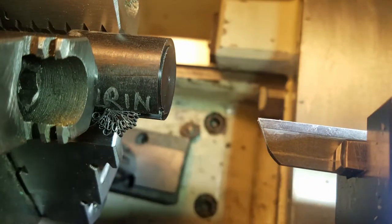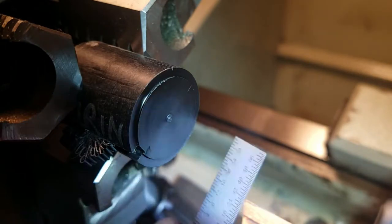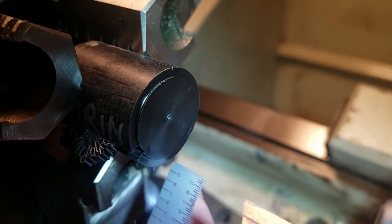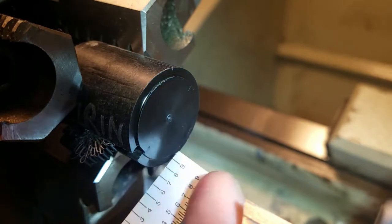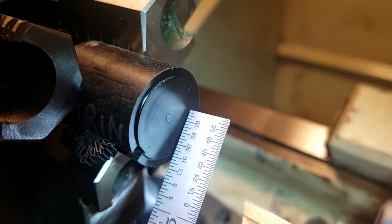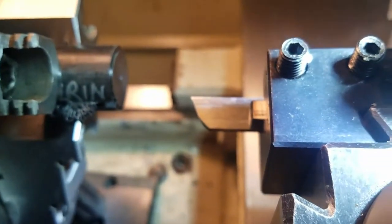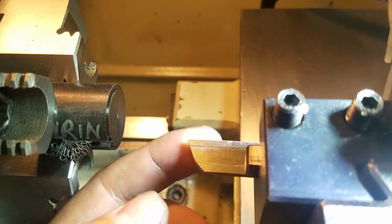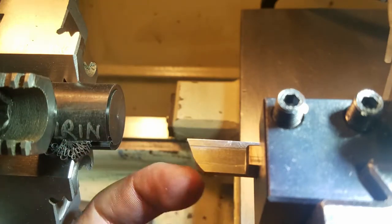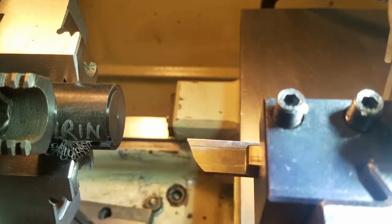There we go — those are all the passes. I did this groove so the bottom of it is at center line. I should be able to remove all this material and then cut this in half about there, and I'll bore out the middle to the correct diameter — that should be pretty easy. I don't really have a great way to index this chuck, so what I'm going to do is leave it locked with this jack, take out my tool, flip it over, and go onto the other side and do the exact same thing with the cutting edge on that side. I should then have these two on the exact same plane because I won't change the height of anything.